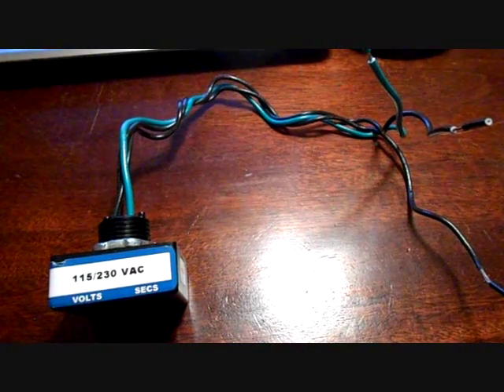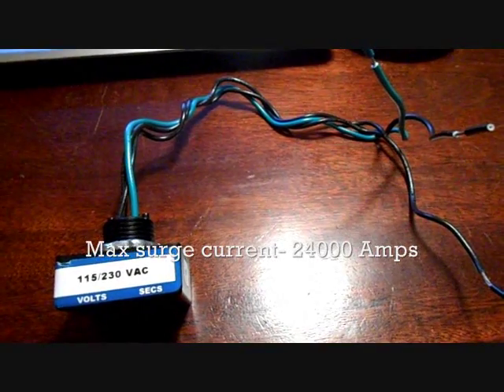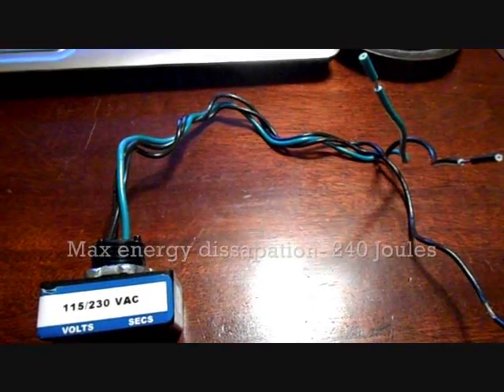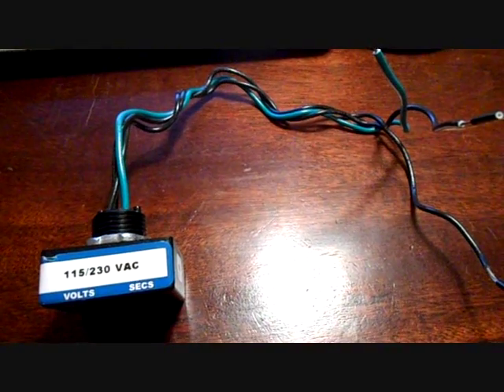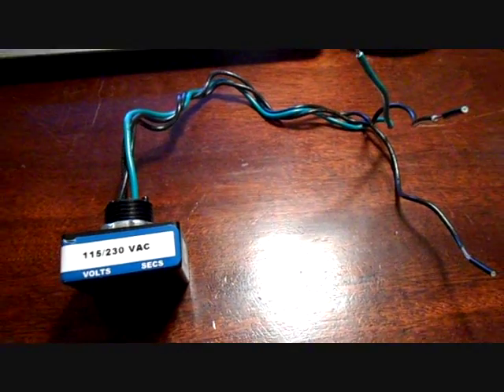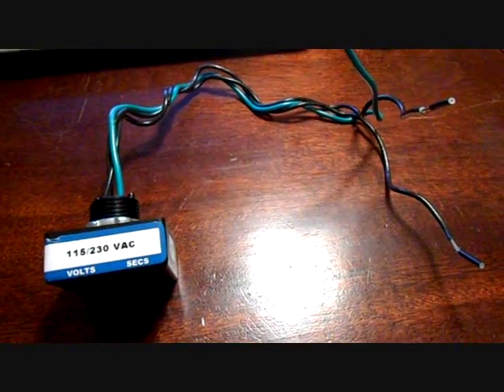The ICM-515 is a surge protector. It absorbs some of the surge — the amperage and electricity from a surge — and routes it into the ground bus so your equipment is not damaged and your circuit boards aren't fried. In this video we'll go over how that works, how we install one, and where we install one.